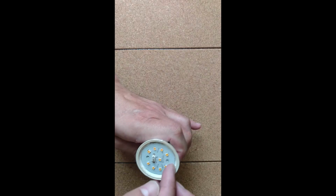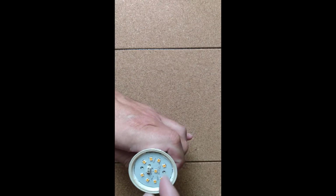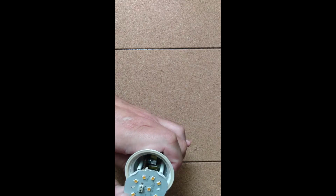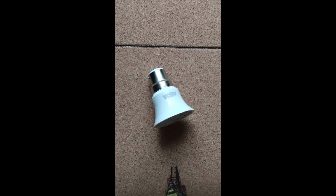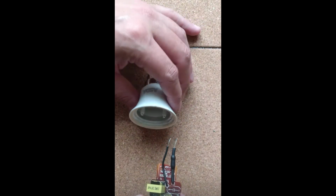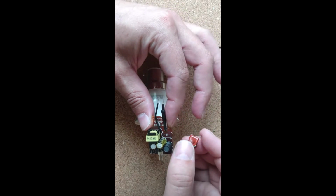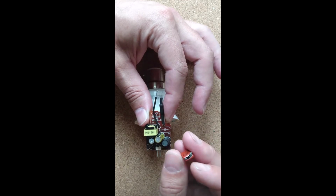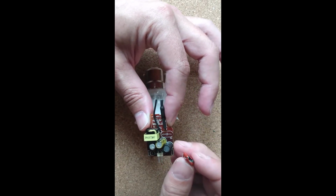So you take the screws out, and there are two little metal pins there that I noticed this just pushes over, so I could actually flick that out, bearing in mind I've done it already. So it was glued in a little bit. You can see some edges of glue on there. So I'll put that aside, and then you can see inside now, hopefully. Okay, so as you can see, I've managed to remove the circuit board out of the chassis, and when I first took it out, this component here, which I'll now show you, is a film capacitor, and it has completely melted and burnt out, and that was in that piece there. So I pretty much figured that that's why it's gone out.